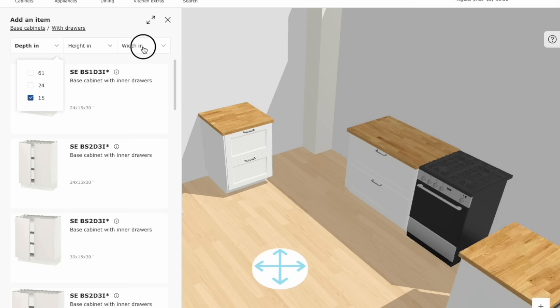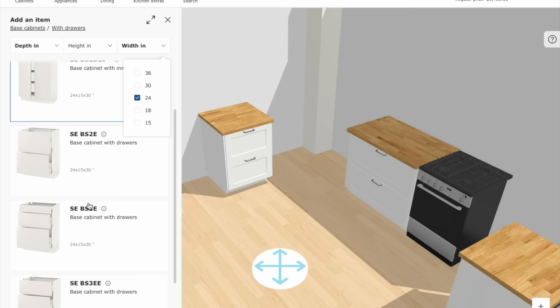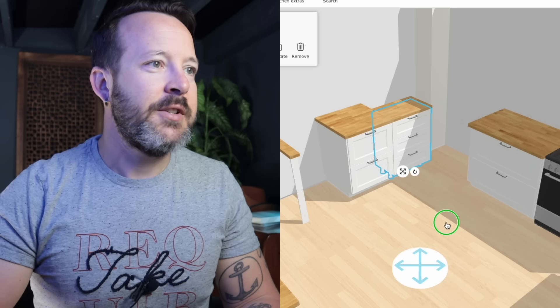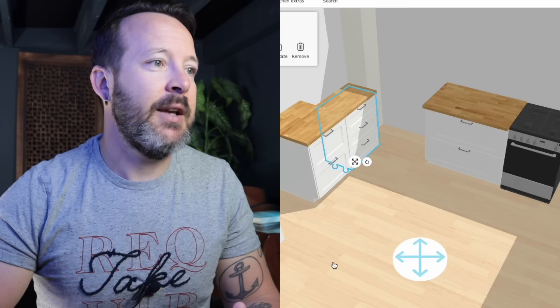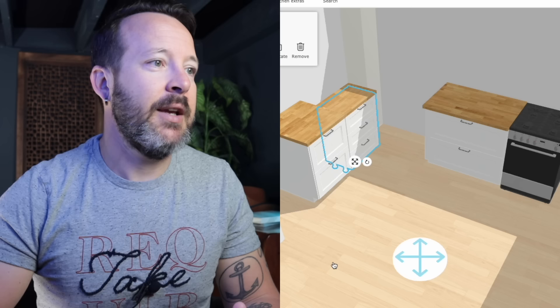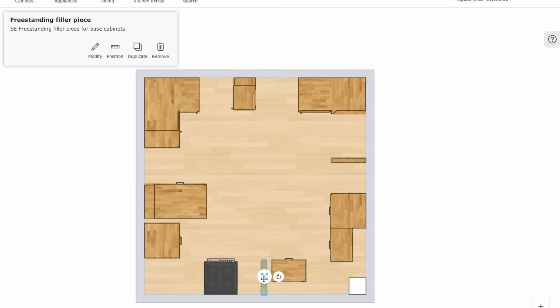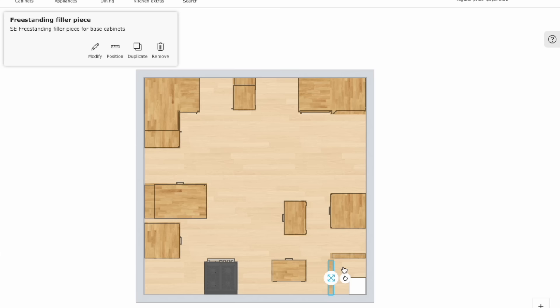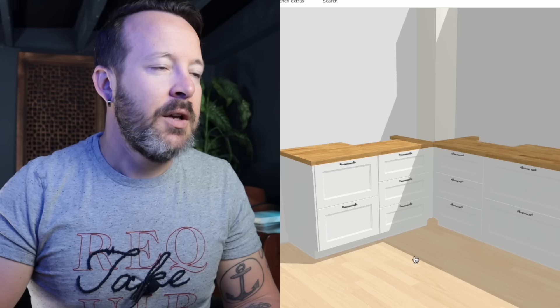But let's try something different. Go to cabinets with drawers and we want something that's 15 inches deep and 24 inches wide — here we have some options. We'll do one with three drawers, put it on the floor plan, and line it up with the front of that pipe chase. I'm going to create a shallow corner base cabinet solution, using fillers in a moment. We'll do this on both sides. Duplicate the cabinet, pull it out to the front, create a corner base filler using a regular filler, and take the corner filler and move it over. Now we have our corner blocked off. Take these cabinets and line them up to the front.